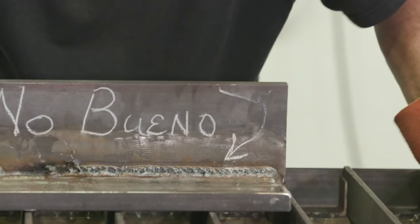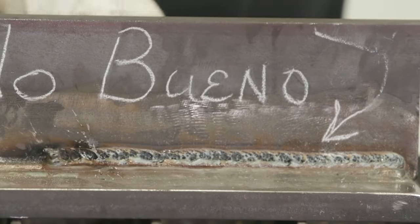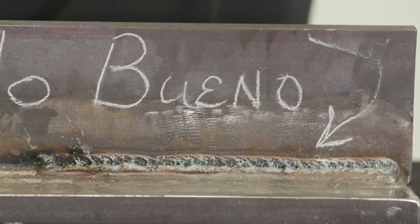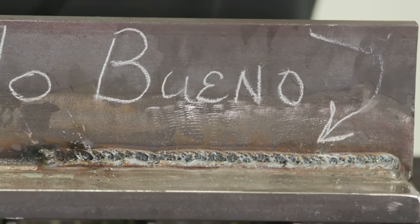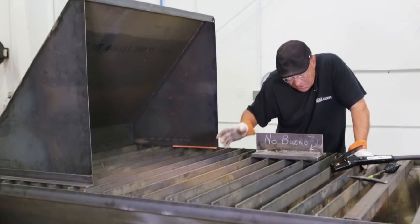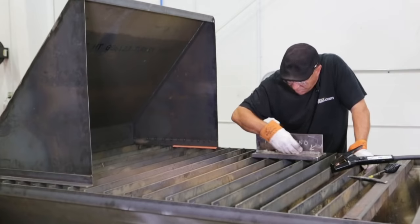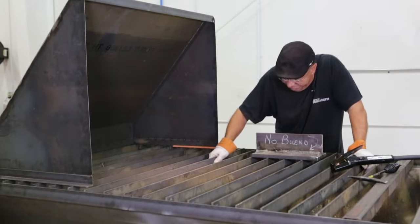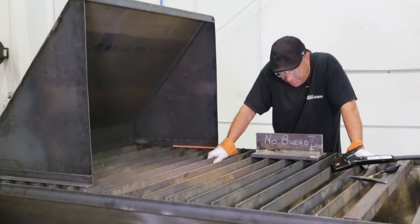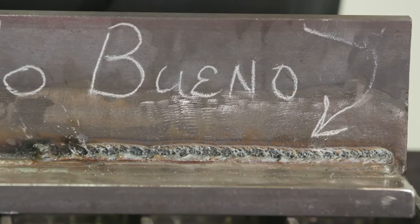I've got a repair to make, and it's a big one. If it was something like this side over here and it was just a couple of inches, a little bit of porosity, I'd just grind it out. But I really don't feel like grinding all of that — I want to carbon arc cut it, do a demonstration on how to cut that out, blend it in, prep it, and I'll just fix it with 7018, just to simulate something that would blend this bead back in here in a different process. So that's a mess.